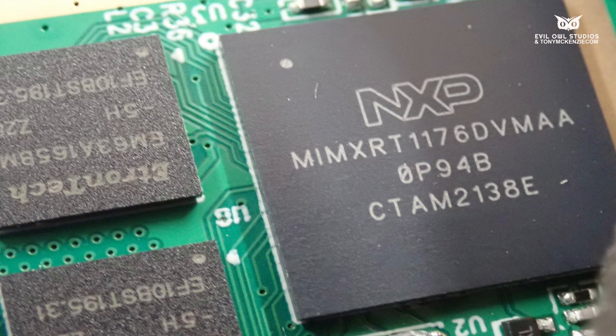Strangely enough, this chip, like a lot of the ones I've seen in more recent times, is an ARM chip invented by basically the guys from Acorn Computers and taken forward as they went. It's an ARM Cortex-M based device and it's got 6,468 total core marks with Cortex-M7. That's 1 gigahertz plus Cortex-M4 at 400 megahertz, which is moving along a bit.